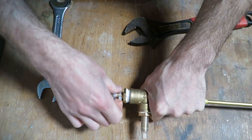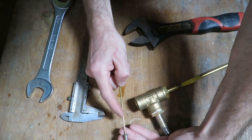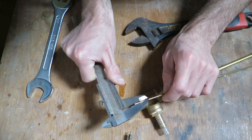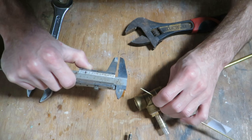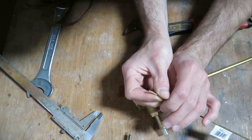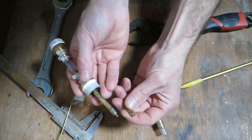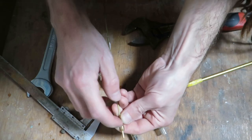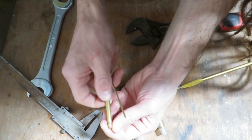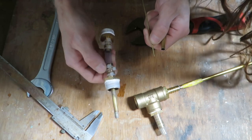So let's look at how this is built. I used this tube — it's two millimeters outside diameter and looks like 1.5 or 1.6 millimeters inside diameter. What I did is thread this tube through a fitting of some kind, then stick this thing inside the tube so it's nicely centered, and soldered the whole thing. That's one way to do it.